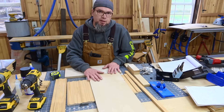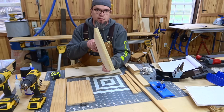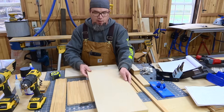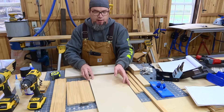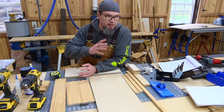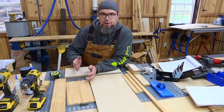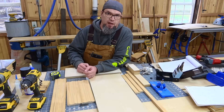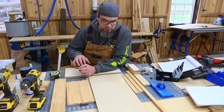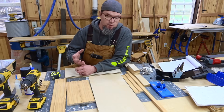The top and bottom are all going to be made out of three-quarter inch cabinet grade plywood. If you're doing multiples, get your graphing paper, lay it out, and you'll know exactly how many pieces you can get out of one sheet. Don't go cheap on your plywood — get a nice cabinet grade so the finish really pops if you decide to stain these.